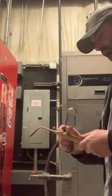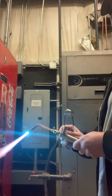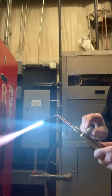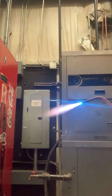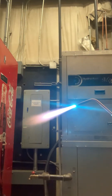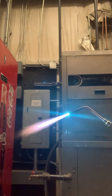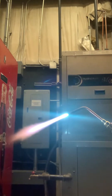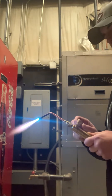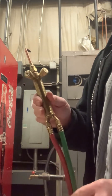Welcome back to Kale's workshop. In this one I'm doing a quick oxy-acetylene torch setup, going through the oxygen and acetylene adjustments, showing you a neutral flame, oxidizing flame, and a carbonizing flame. It's hard to really tell what's going on here so I'll go over this in the next clip. I end on a neutral flame when you see that well-defined blue inner cone.